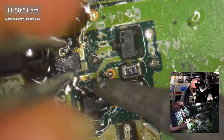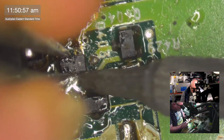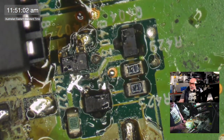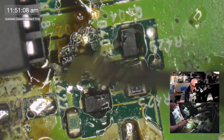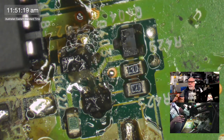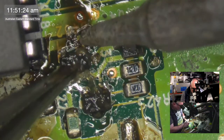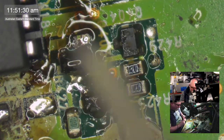What I do with those cases, that's the 6100, 610, 660AV, all of the ones in the family size pizza box, I file off the little bit. There's tabs on the back and they clip onto a thing. I file off the little lump that makes them clip so that when they go down, they just sit. It's fine because if you've got a monitor sitting on them, they're all held in place. They're not going anywhere. But that's what I do. That's my thing.